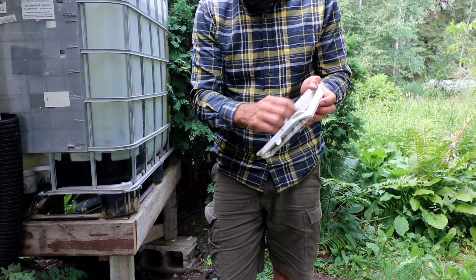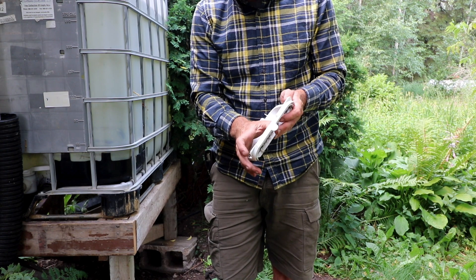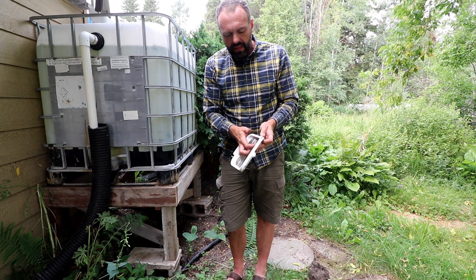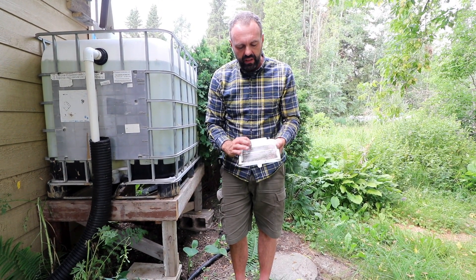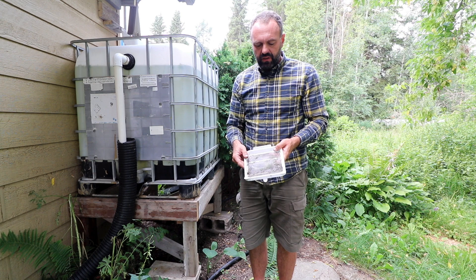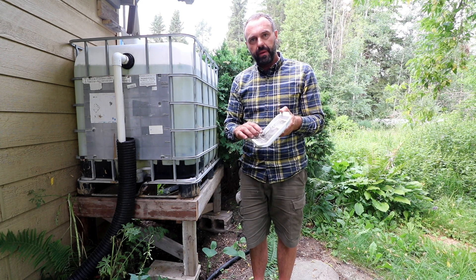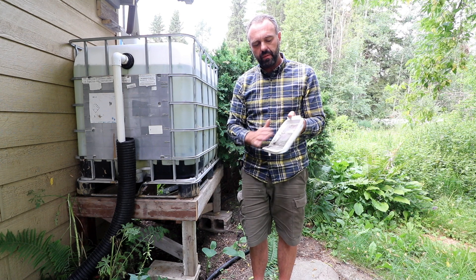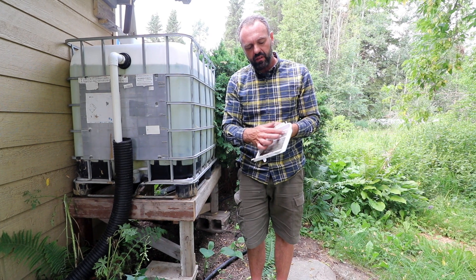You might take it inside and wash it. So what is this called and where can people get something like this? This is the filter on top of a rain head. In Canada you can buy it from Bar Plastics out of BC. There are also a few websites — this is actually an Australian product. All it is is a fine stainless steel mesh that filters out any debris. It's on a 45-degree angle, nice and steep, so theoretically in a big rain event it should wash itself clean, but there was some debris that was not coming off, which is why I've cleaned it. I might even take a brush to it — there's some algal growth in there.